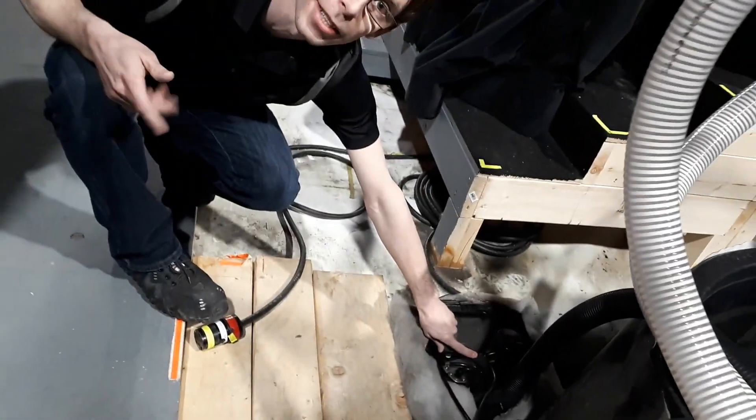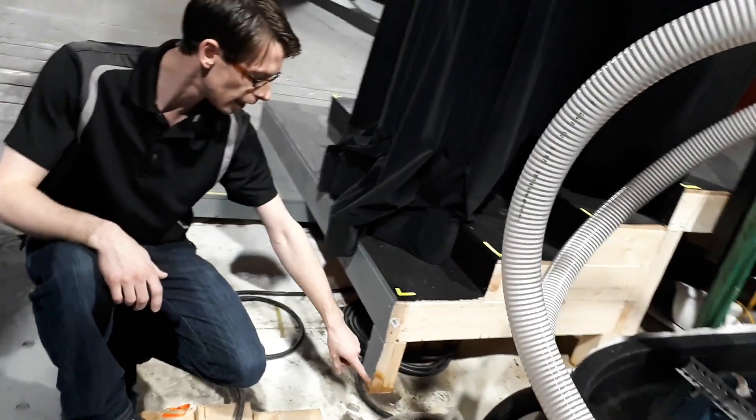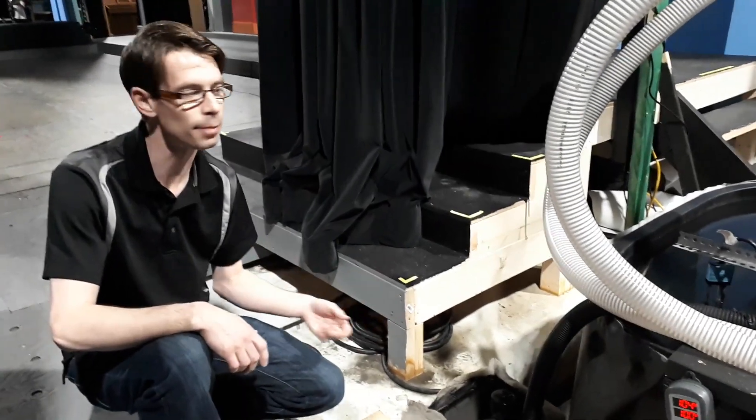In the trough is a pump — just a regular sump pump rated to 120 degrees Fahrenheit, three-quarter horsepower. After the float valve fills up, after the trough fills up, it activates the pump and pumps the water back into the tanks.